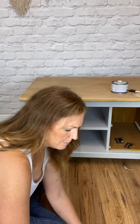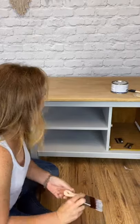Felicia, you're struggling with the gel stain — are you in a particularly hot or humid place? Because if it's humid it will take much longer to dry. If you're going over an existing finish and wiping back, the dry time is significantly less. You may be better off doing thinner coats — two or three thinner coats — rather than one thick coat. I did a top recently and did two coats, leaving a day in between. If you're in a really humid state in America right now, that will prolong the dry time; using thinner coats should help counteract that.